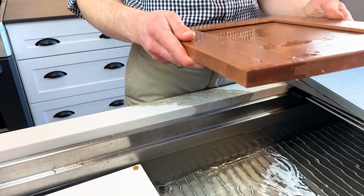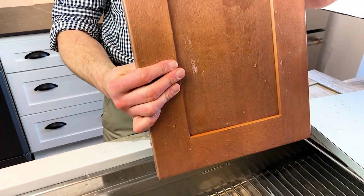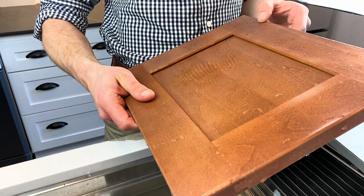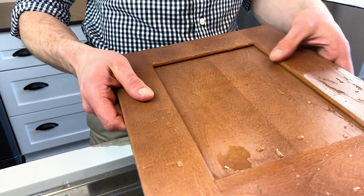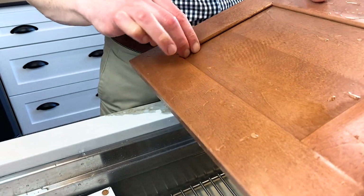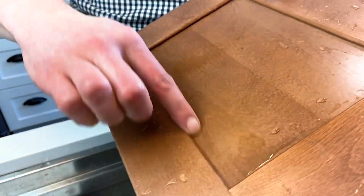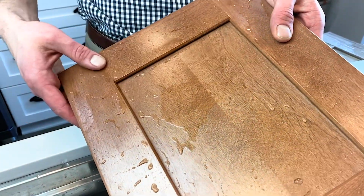Next, let's check out our stained door sample. What's happened with this stained door sample is kind of what I would expect. It's cupping. We've seen some swelling. We have a couple of areas where the finish is cracked, and I can see that it's going to damage it even more, but hasn't yet. We have a little bit of swelling here in the center panel, mostly around the corners, and the joints have started to pop just a tiny bit, but it actually performed pretty well.